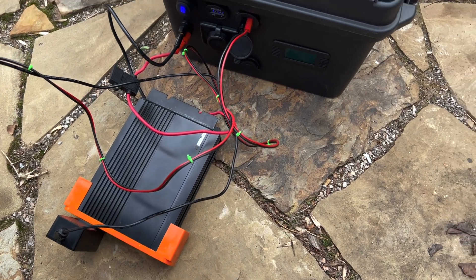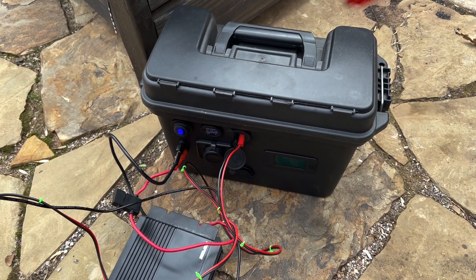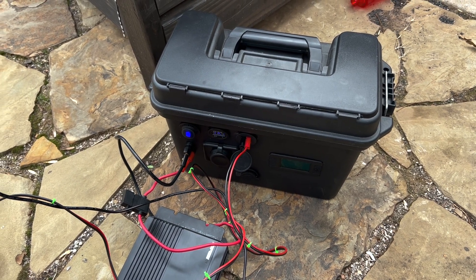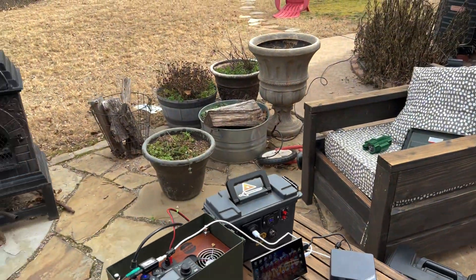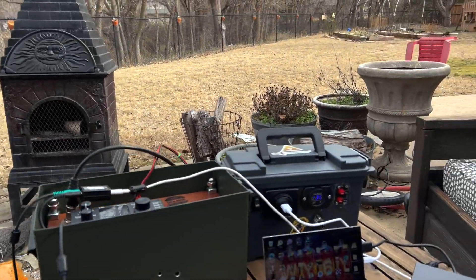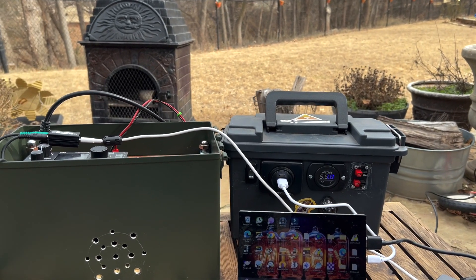Here's the big brother — the 30 amp-hour — and an inverter I pulled out of a piece of photo equipment. It actually works pretty good for this; it powers the PC. Usually if I'm doing digital modes with the Xiegu G90 I use FL Rig, but Winlink doesn't have an FL Rig CAT command file, so I use the ICOM 7200 file and it works fine.